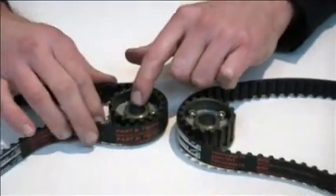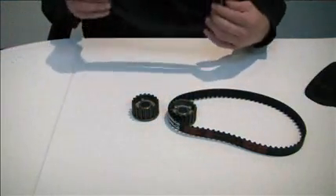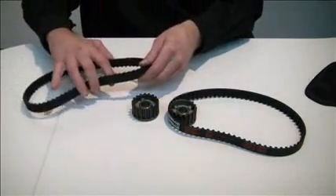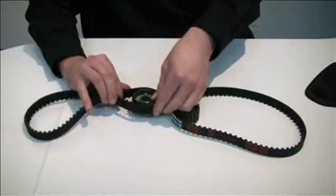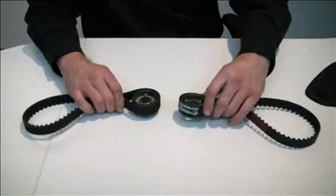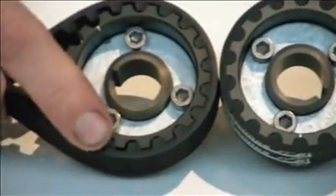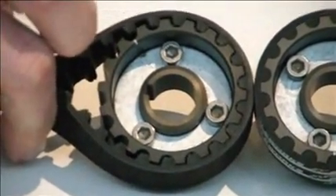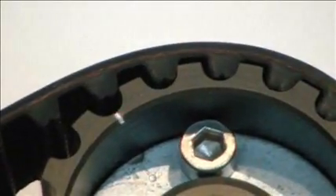So we'll leave our 900 belt out and set aside our 696 belt, and bring in a popular aftermarket 900 belt. These belts have been on the market for years, they're considered reliable, and people have been putting them on their 900s with no problems. However, you can tell that by the time you get around the sprocket, the pitch is a little bit off, and you can see that the tooth profile isn't the same between the two belts. Upon the realization that our engineers didn't want two belts that looked identical to be interchanged, it made me realize perhaps it's not the best of industry practice to have this other kind of belt.